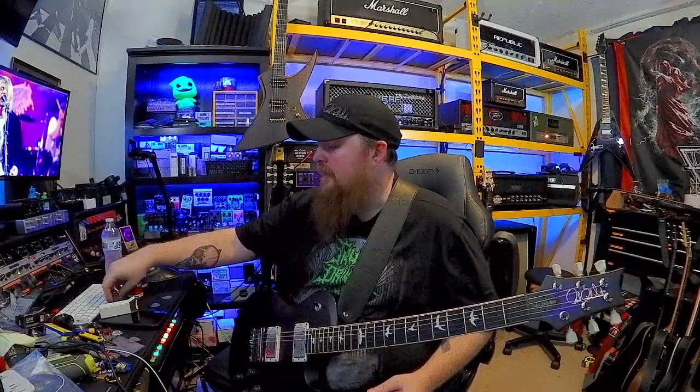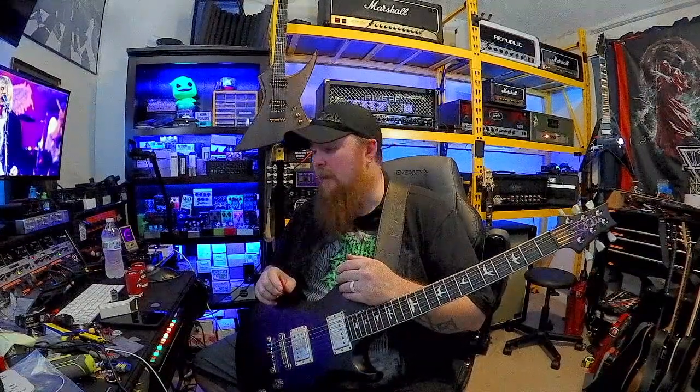So, currently installed, and the amp is already on. You can see the orange glow on the light. So currently, we have a JJ 12AT7 in the V1 position, of course it's new production, and then we have a current production EHX 12AX7 in the phase inverter position, and then I run current production, whatever you want to call it, Mullard EL84s. So it's a matched pair of those. It's an 18 watt amp. It's not meant to be super loud or high gain, but it's lovely.